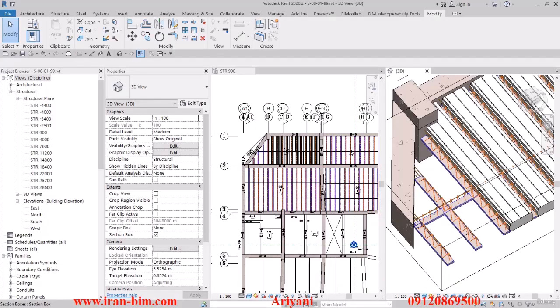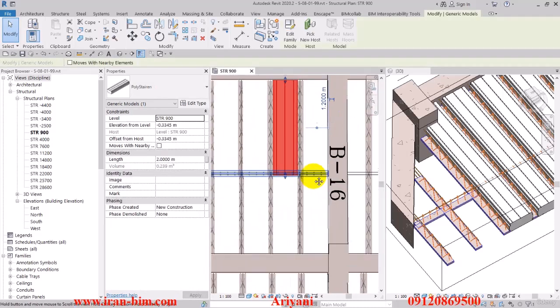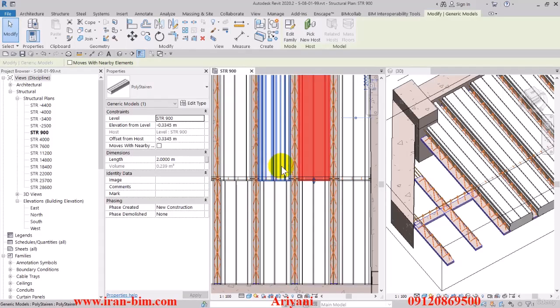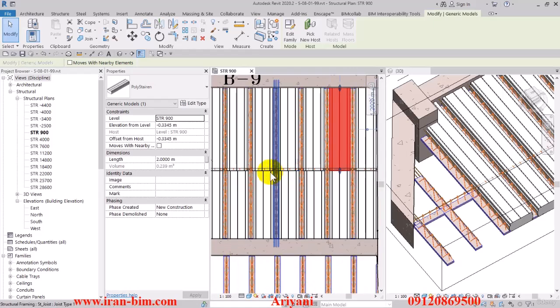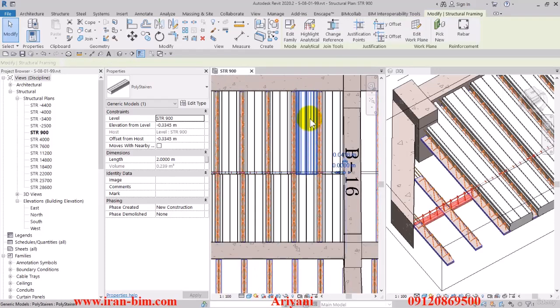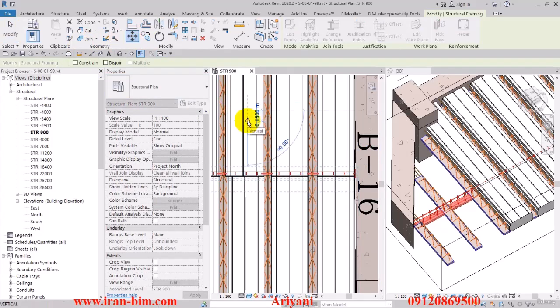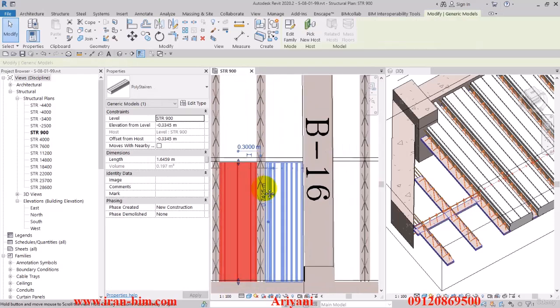So after that, for the tie beam that we have here, we need to empty out an area here for about 12 centimeters, so we can place the tie beam here. I can select this part and put one side on 2 meters so we won't have any unevenness. And then using the move tool, I'll move it for about 12 centimeters so that we use the excess material